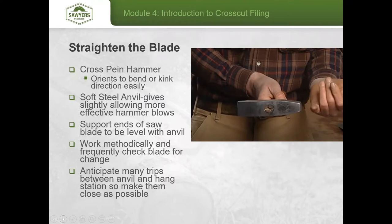If you're hitting with the top or bottom edge of the hammer face, you won't be nearly as effective and may create dents. Don't swing the hammer very hard — do most of the work using gravity. Lift the hammer and let it fall on its own, especially when starting out to get a feel for the swing.